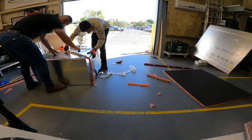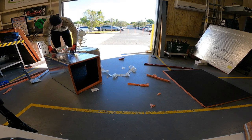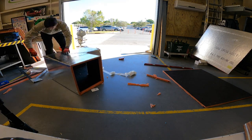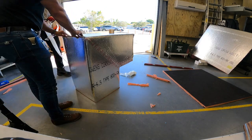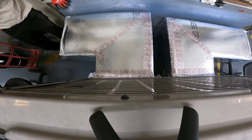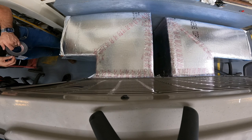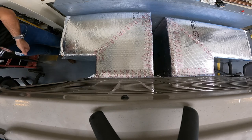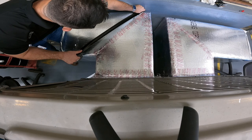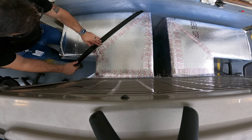German is going to go ahead and tape up his plenum box, finish putting it together, and get it ready to attach to the system. They spent about five minutes attaching it — two of them total — taping it up well and making sure there were no big gaps or air leaks. We then went on to a discussion on how to stand out. One way to stand out is in how you apply mastic to the plenum. The perforated lines across fiberglass duct board can allow a small amount of air infiltration, so duct sealing with mastic at the end is important.